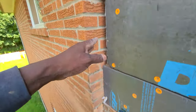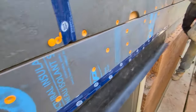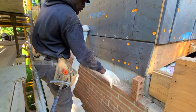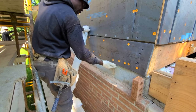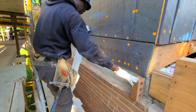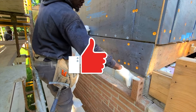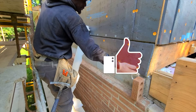So here we're going to go with a control joint, go all the way up, and it's going to be a seal right here. We're going to install some Tyvek. We're going to go with a soldier course hangover, maybe half an inch. We're going to install some Tyvek once I reach up to around here. We're going to put our weeping plastic right on top. Actually, I'm not going to put the Tyvek yet — I'm going to install one course of brick first, and afterwards we're going to put our weeping plastic right on top.